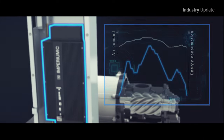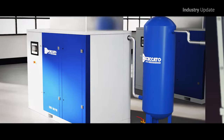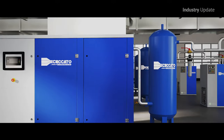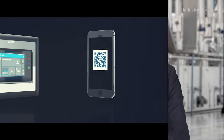The frequency-driven compressor has a working pattern with lower peaks and a smoother air profile. This is achieved by controlling the air delivery and producing only the amount of air for the customer's application at a daily lower cost of operation. The net pressure is maintained by use of a frequency inverter. As a result, the compressor consumes only the energy needed, which is very cost efficient as well.